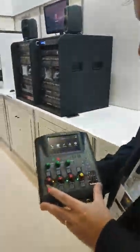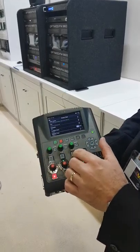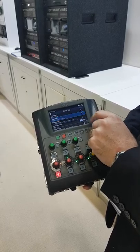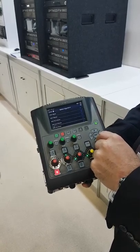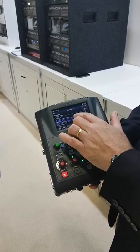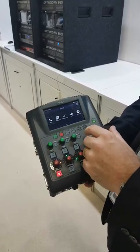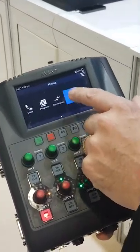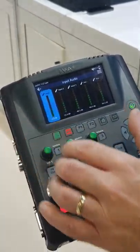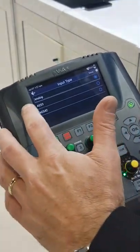On the front panel here we have a full user interface. You can go through and select what type of transport you want, select what algorithm format you want to choose, the destination, and if you want auto-reconnect — all the things you'd expect for IP networks. Under audio, you're able to configure the inputs, so you can switch input one from analog to AES-3 and AES-42.